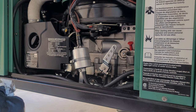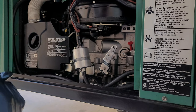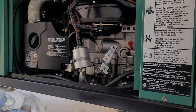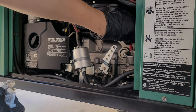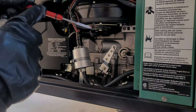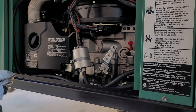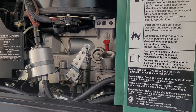Because I saw that oil leak, I'm going to go ahead and service this filter screen again, just so I can narrow down where my oil leak came from. All I can think of is that my filler cap or my dipstick was not on all the way, but it does have two O-rings so I find it hard to believe it could bypass through there. If there's enough pressure, it could make it through. So let me go get an Allen wrench and service this screen filter.